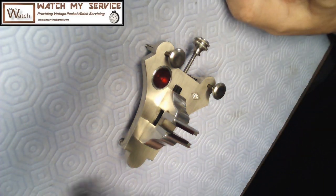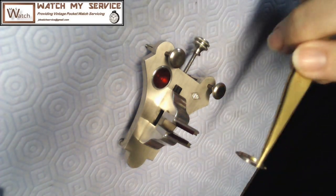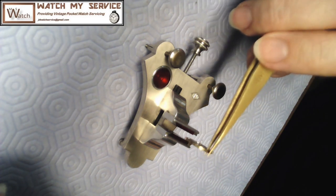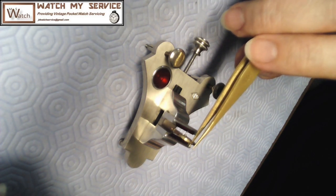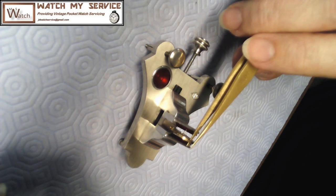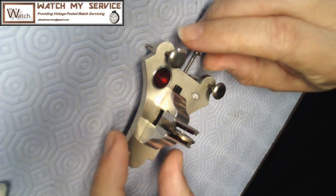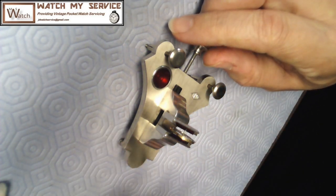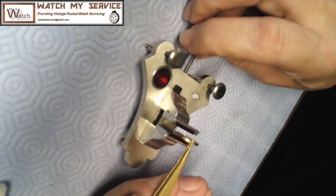I'm going to grab my tweezers and take a balance where one of the pivots is broken off - that's no good for actual use but fine for this demo. You want to lay the balance onto the jaws using your tweezers ever so lightly, just lowering it down like this. I've got the jaws not quite right - the other thing is I'm on the wrong side of this because I want to make sure the jaws are far apart enough that the tips of the pivot are touching the jaw.